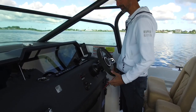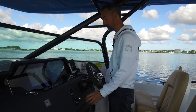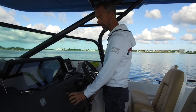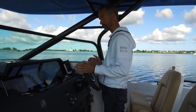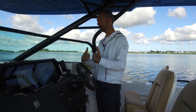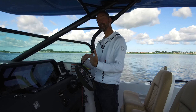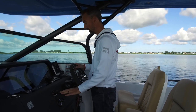There are also trim tabs, which aren't really necessary but in some conditions may be interesting to have — for example, every planing boat tends to lean against the wind and you can compensate for that with the trim tabs. This boat also has the Active Trim feature, which I tend to forget to explain because I'm getting more and more used to it and find it more or less logical that every boat in this caliber has it. It's a system where you don't really have to worry about trimming the engines — you just put it on, set a preferred mode from one to five, five being the most aggressive way of trimming.